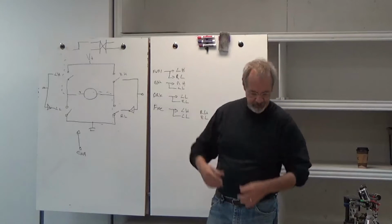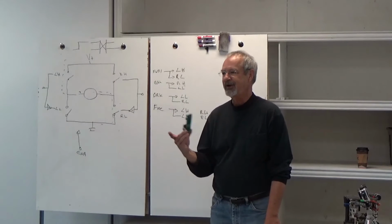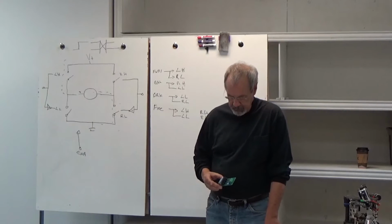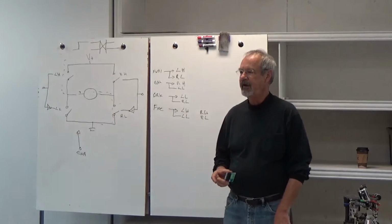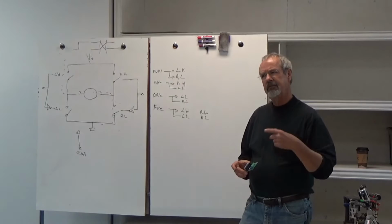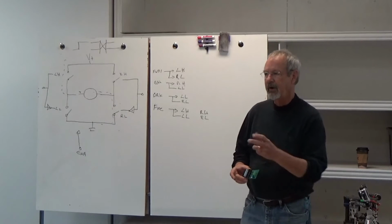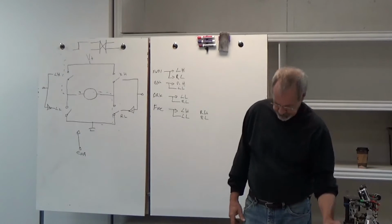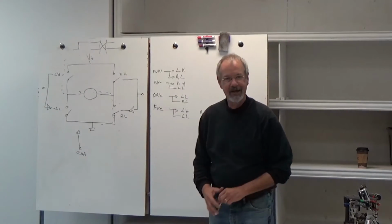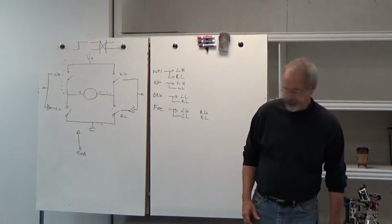There's also a step up from that, and actually this Devantech is one, which is an H-Bridge that has a microprocessor built into it that can do things for you. Pololu makes one called the RoboClaw, which is a really nice part. SparkFun has a bunch of them. Generally, they have serial or I2C or something like that, and you can do all kinds of programming. That's very common now. Rather than just buying the raw H-Bridge, you buy one with a microprocessor that does stuff for you, including counting your encoder ticks, running your own PID controller, and all this other stuff. So, okay,